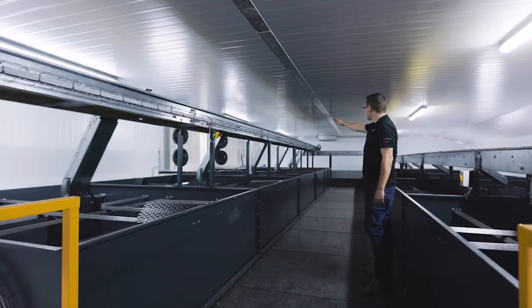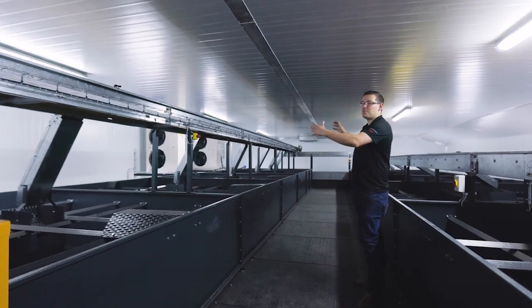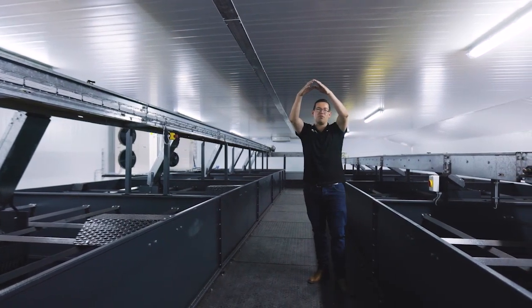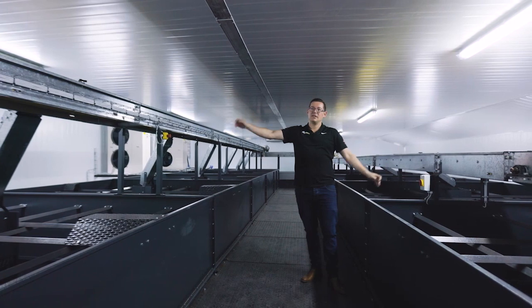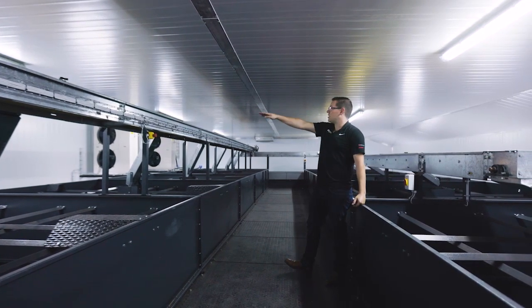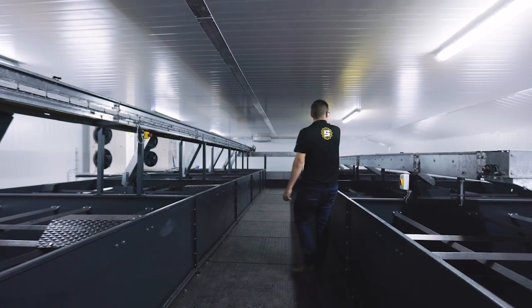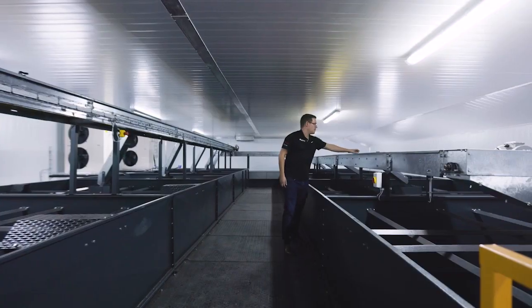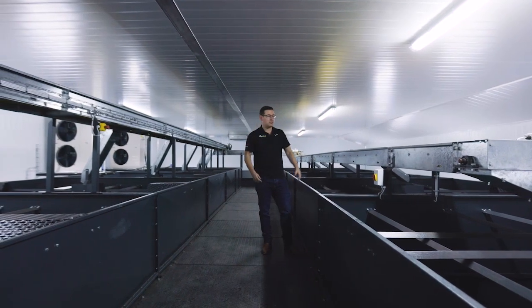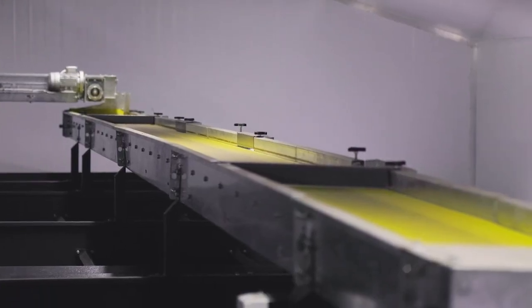over the scraper conveyors. And what we've opted for in this area is, instead of having one conveyor belt in the middle of the walkway that splits across, we've opted to open up this walkway by putting in a scraper, a cross feed, and another scraper this way. So easy to clean, easy to operate, built nice and low, change your belt, easy to actually see what's happening with the product.